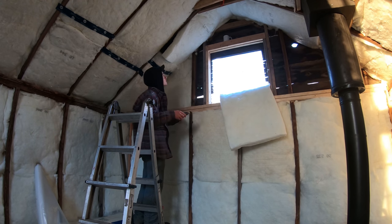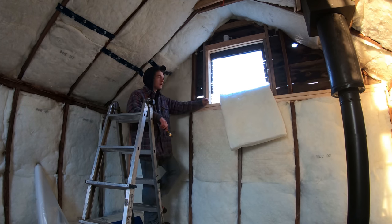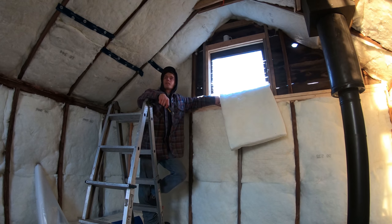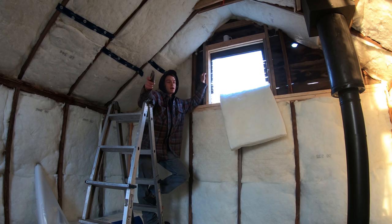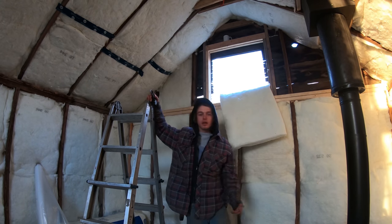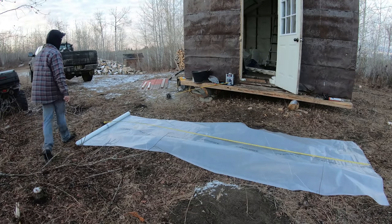Same on the other side — this is the last of the insulation. I need to figure out how I want to put the vapor barrier, plan out how I overlap the sheets. I think I'll first do the triangular sections, then run along the roof, do the top pieces, then come around and do the bottom. Getting a little irritated now — it's starting to get in my nostrils and stuff — so glad to get the insulation done.